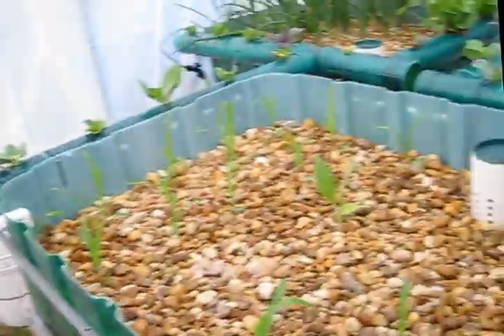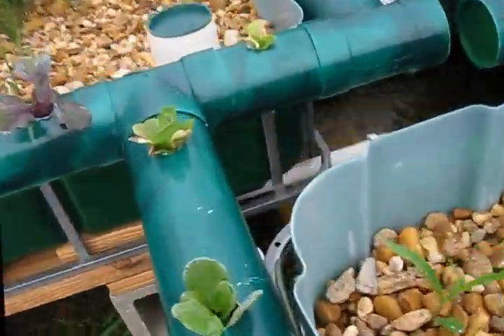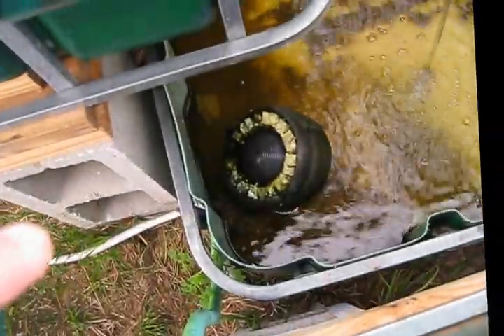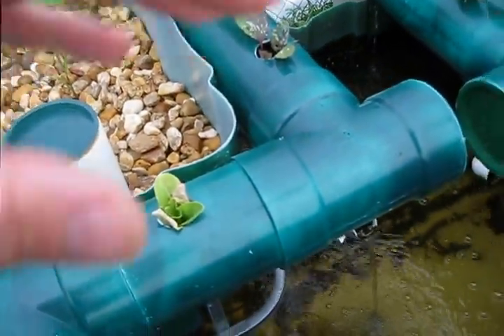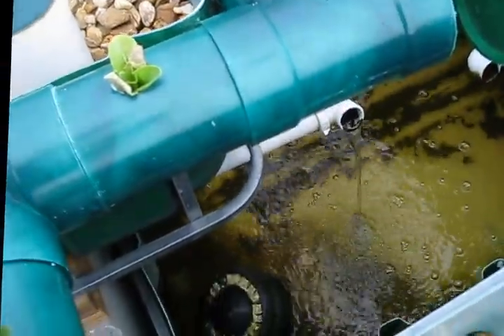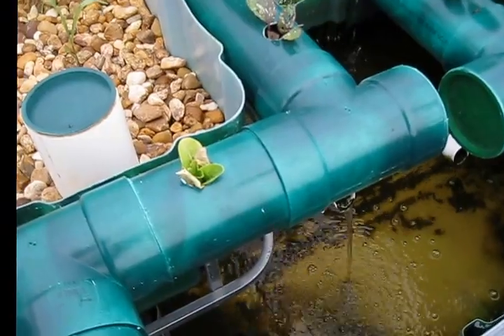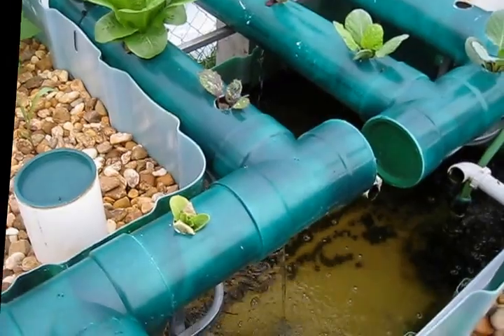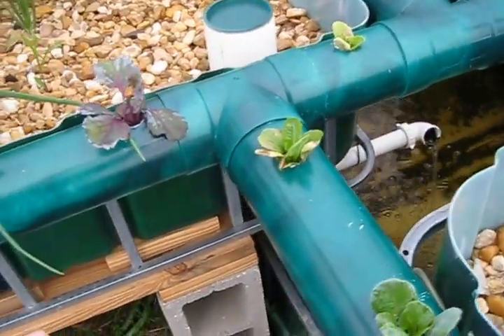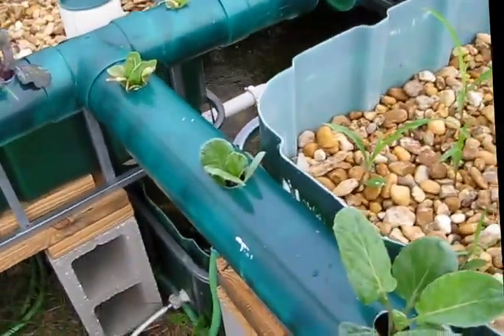I had to modify this — all it is is a toilet float valve assembly in here sideways. You have to take the cap off; there's a little O-ring on the plunger — just remove that O-ring, there's no need for it. Because this is gravity feed, you want a minimum amount of friction. All it is is a flat washer that seals a hole, and it works perfectly. As that calls for water and it rains, it fills, and when it's at a certain level, it stops.